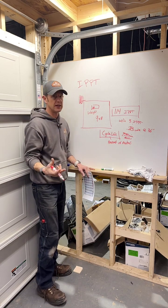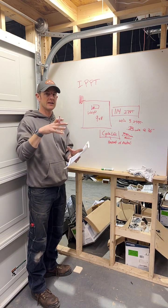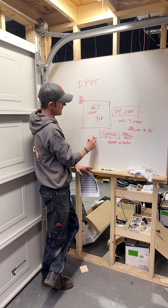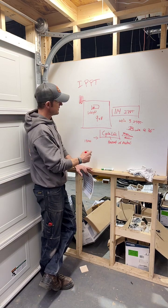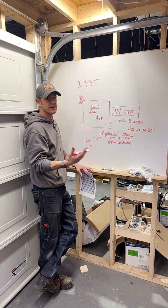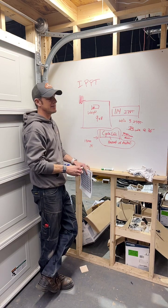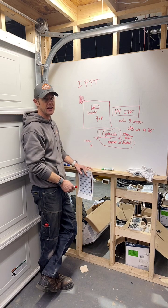If I go up to a 283 wire, or if I increase the ID and get a bigger spring on there — more metal in a more condensed zone using a three and a half inch ID or a five and a half inch ID — I can add cycle life. We can take a 10,000 cycle life spring, which is industry standard, and bump it up to 25, 50, or 150,000. This is how some folks are getting those quote-unquote lifetime springs, because they're putting more metal on the door with the same IPPT as what would come up by default in any app.